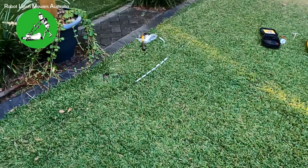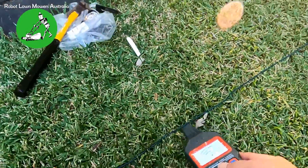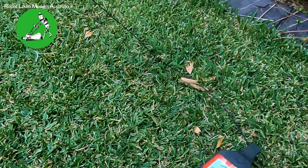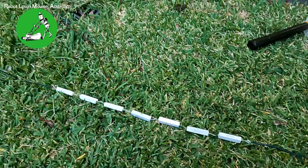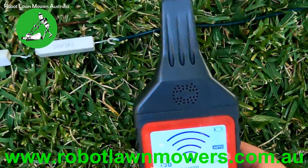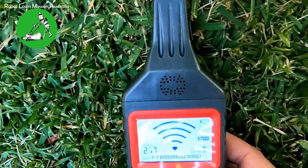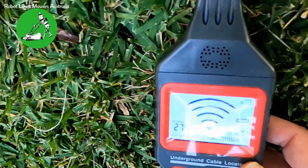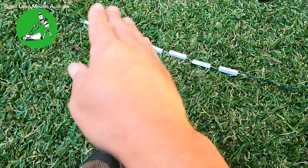In this case 7,000 ohms is not that difficult to find. Going every five meters: readings of 300 and 305 on this side, then 285 and 248 on the other side. That tells me there's definitely an issue between those two points. With the NF826 you can also see the difference between every individual resistor — you can watch the reading drop further and further as it passes each one.